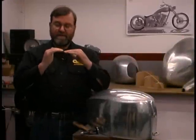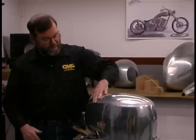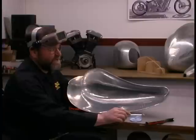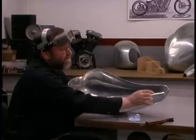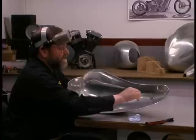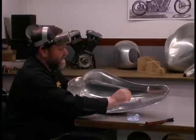Now that we're certain that the metal is at the same level at the joint, we're ready to come in with the oxy-acetylene torch and complete this weld. It takes a few special things to make an oxy-acetylene weld. You need to use a special flux — this is aluminum welding flux — which comes as a powder that you mix with water to make a light paste, and that paste is brushed onto the joint, both on the inside and out.